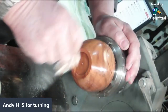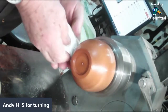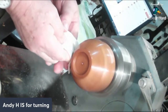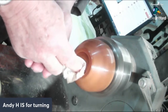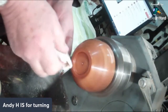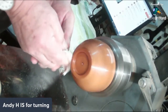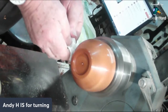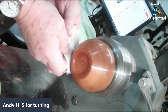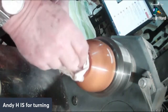And they're now discussing using a belt sander and what sandpaper or grit you use. A lot of the grits that come out for belt sanders are sufficient to take off a small amount of steel. Again, yes, you don't want to put too much weight on the steel onto the belt, because you can still either cut the belt or take all the grit off in one specific spot. So you need to keep it moving around. Yeah, because it's not really designed for anything that hard. No, unless you've got a decent jig set to it, it's not the easiest to use to sharpen.